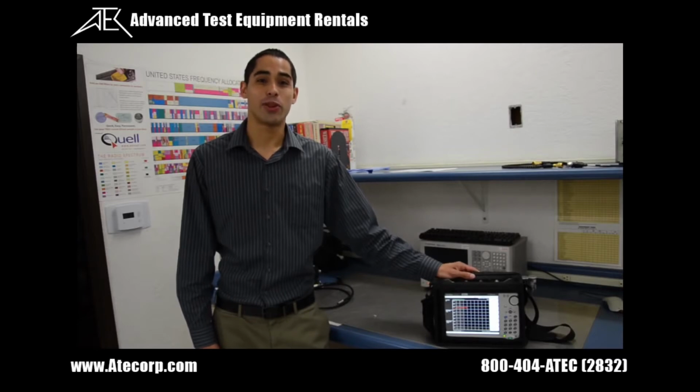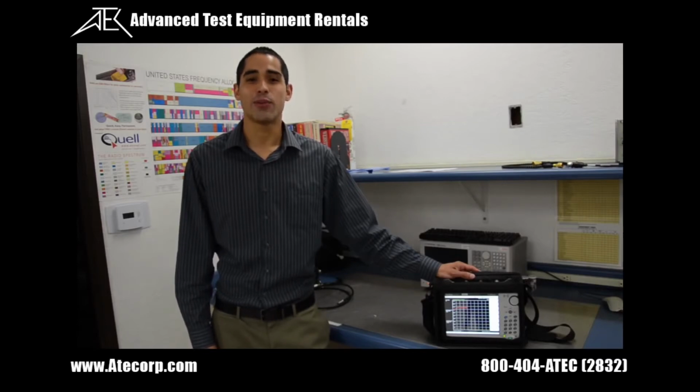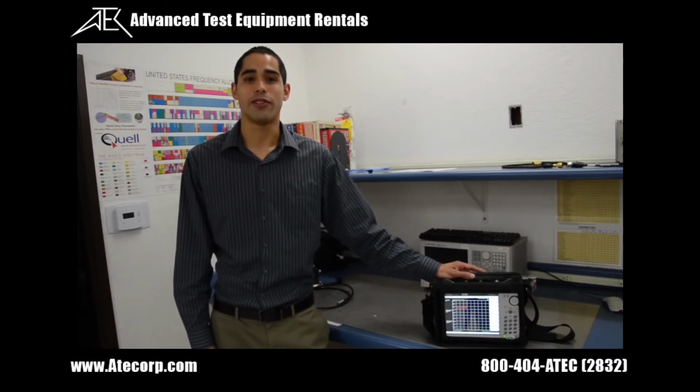S332E right here, which we're going to go over a few of its key functions and a few of its basic tests. What makes this S332E so special is it's a 2 megahertz to 4 gigahertz cable and antenna analyzer, as well as a 9 kilohertz to 4 gigahertz spectrum analyzer, all in one portable, rugged, battery-powered unit.